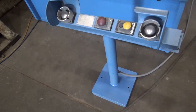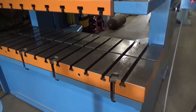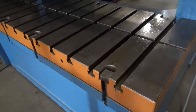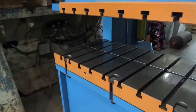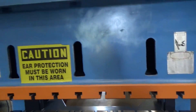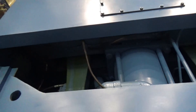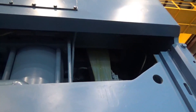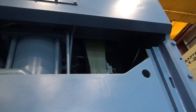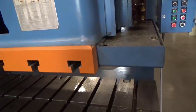This is the upper limit — stops automatically. This is the T-stand for the press. The bolster plate is T-slotted front to back. The slide is also T-slotted front to back. That's your air counterbalance in the middle. You can see the lubrication running down from the upper connections on the left and right side — that's a good sign. This oil recirculates down on either side and through the system.